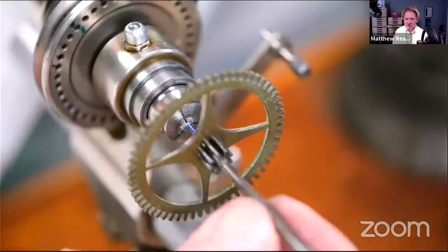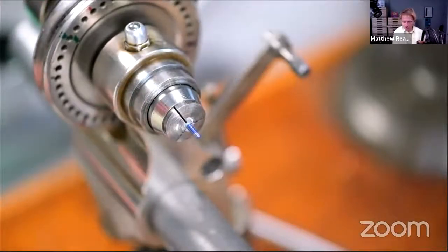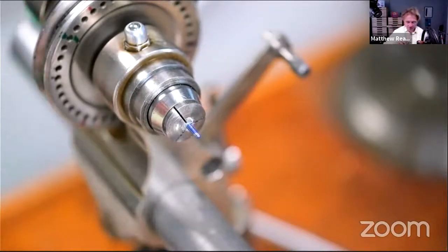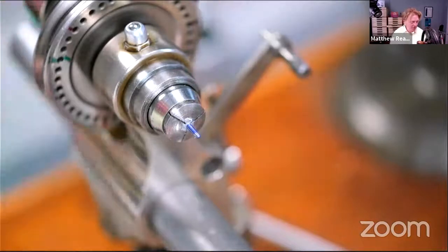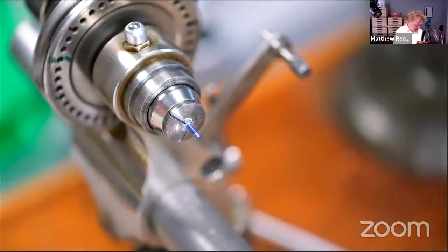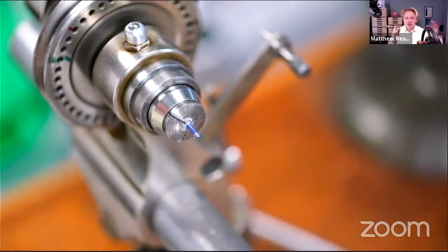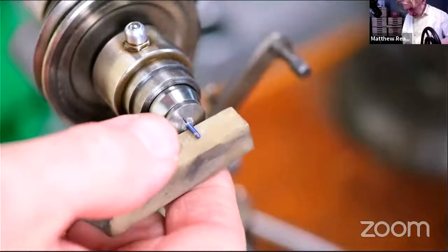I've just put it on there and it's really quite firm. So I'm quite happy, but I just want to check how deep it is, because we said about 2 1/4, didn't we? Yeah, it's about 1 3/4. So I'm just going to do a little bit more, which is probably going to nudge it up. Just a little bit more stoning and just bring that taper, because it's still a little bit tapered.